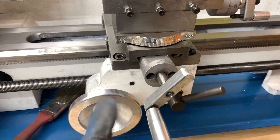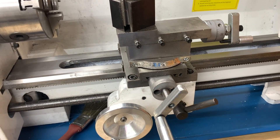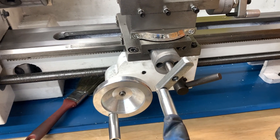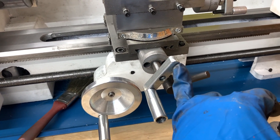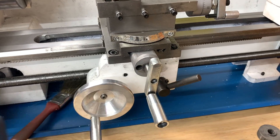So I'm gonna take this off, weigh it, and then I'll utilize my drill press and drill a hole into here. I'll tap it, then turn a piece of aluminum to the same weight as this one — remembering to add the weight of the bolt as well — bolt it on, and that should fix the problem. Let's get started.